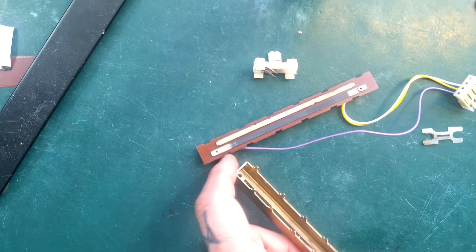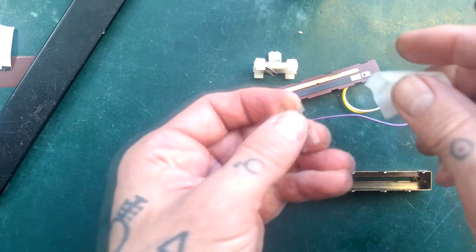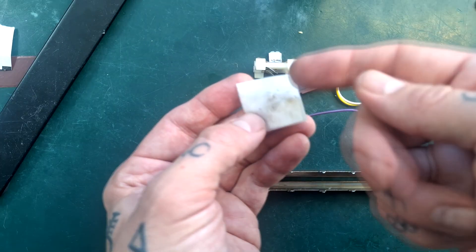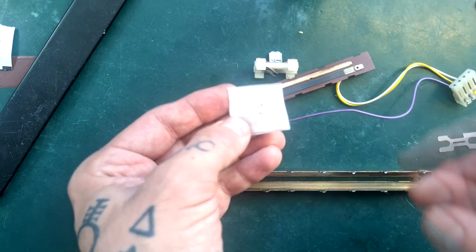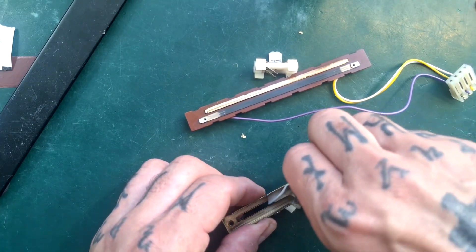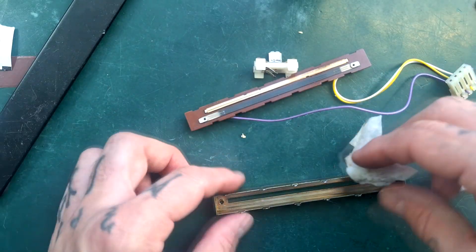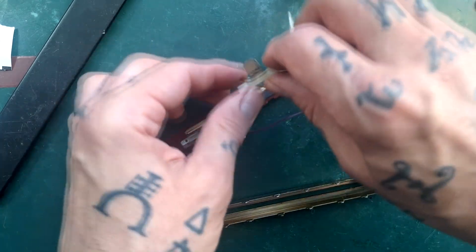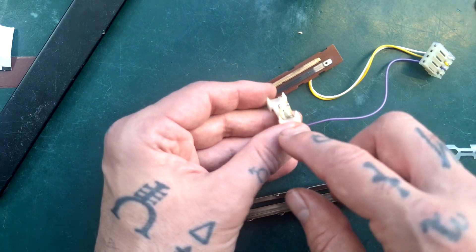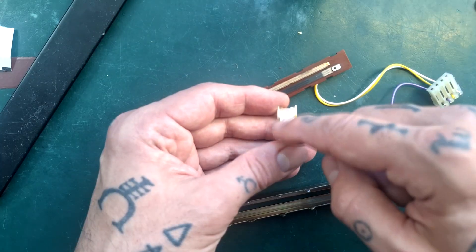You're really going to see a lot of dirt trapped on all the surfaces. The old grease has little flecks of hard stuff in it — bits of dust, bits of skin, could be cigarette ash — and that's just on this little plastic washer. If I move that around, there's quite a lot of muck, and all of that can affect the performance of the fader. We particularly want to get any dirt off the tips of the brushes. In a really dirty example you might actually see a little ball of lint and muck caught on the tips of all of them.